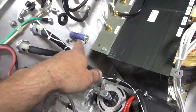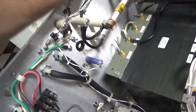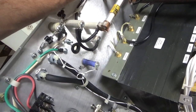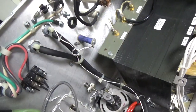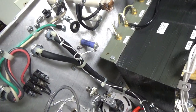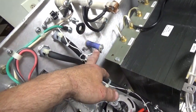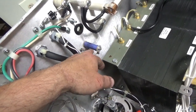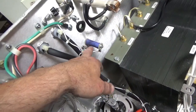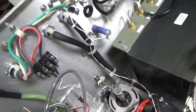Here's that resistor I was talking about — this is the cathode return. So if that jumper were disconnected that I showed you previously, the cathode would never float above ground because it has 25k... I have a box of these, it doesn't have to be this big — this is like crazy overkill, but I have over 100 of these. There's one of these down here and one in the RF deck. Worst case scenario would be floating 50k above ground.